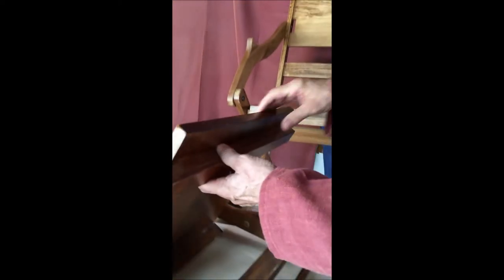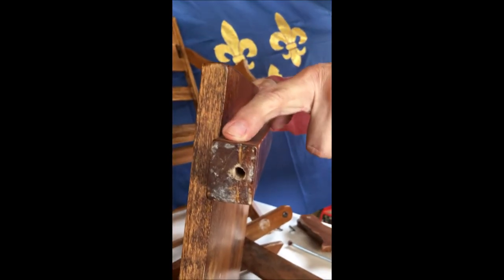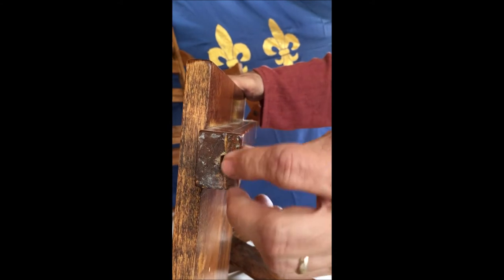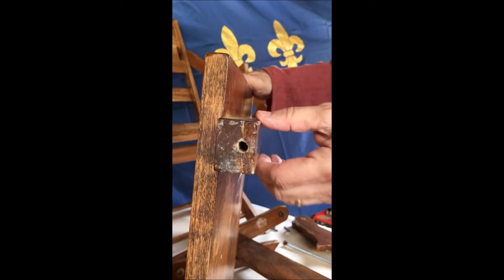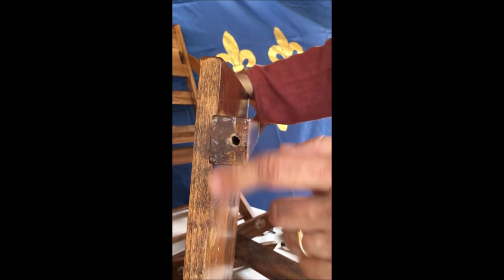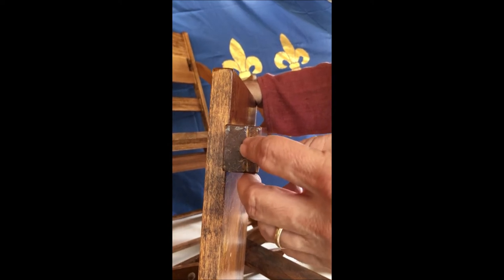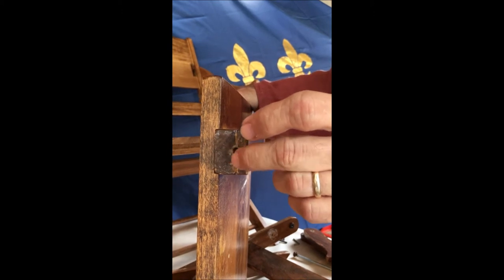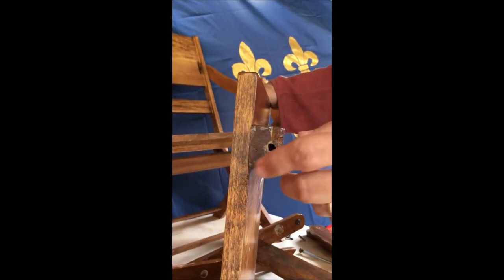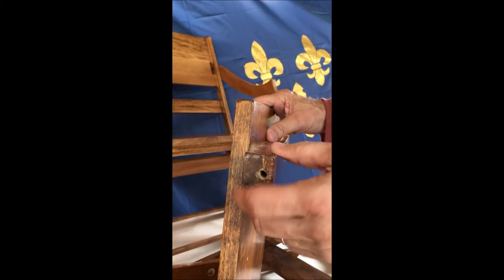That is simply running through a box. This box is constructed with, I believe, a piece of one-by-two — more accurately three-quarter inch by one-and-a-half — and this is also a slat, I believe three-eighths inch, also three-eighths by two. There is a hole made here. You can use a saw blade or preferably a router on both pieces of wood, lay them flat on your router table, and make this channel all the way through. That gives a nice way to hide your threaded rod and puts a little bit of strength into the project as well.